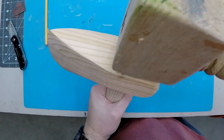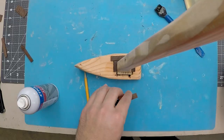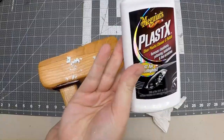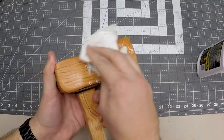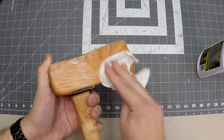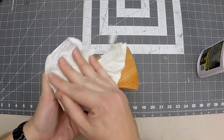I wanted to hide some of the less than perfect square hole that I made, so I cut some thin strips of walnut and boxed in the handle. After completing the axe, I spray lacquer on it and rub in Meguiar's Plastics, which is a plastic cleaner and polish. This gives the wood a super high shine as well as a plastic feel.